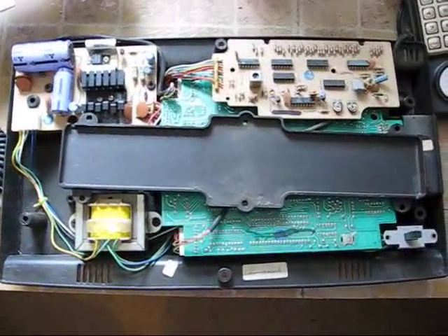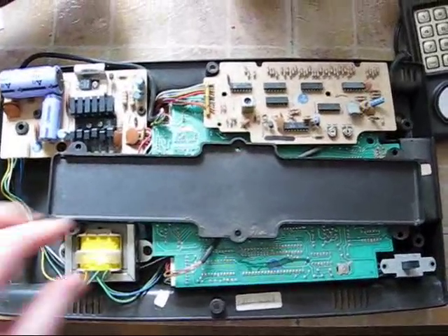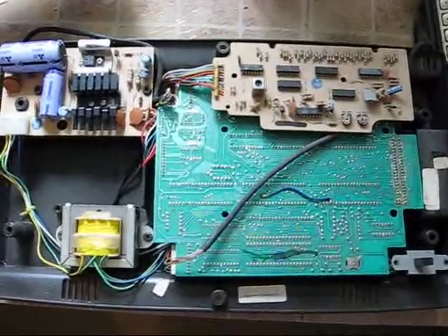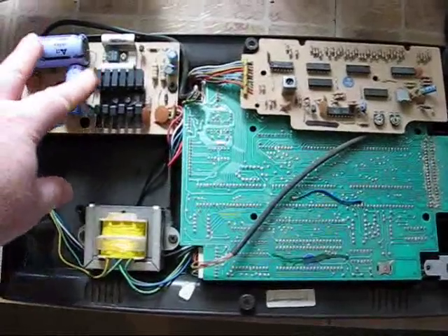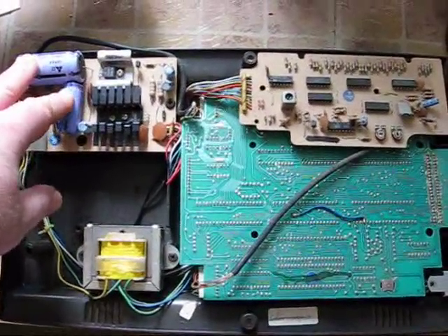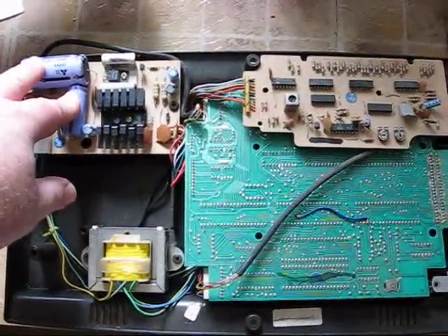Take the cover off. Normally the controllers are fed through the hole, but I've done it this way for convenience. When you've unscrewed everything, you've got access to these various boards. This board takes the main power inwards as AC power and converts via this board into four types of DC power: 16 volts, 12 volts, 5 volts, and also minus 3 volts.